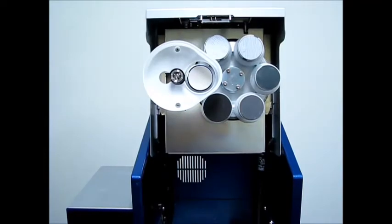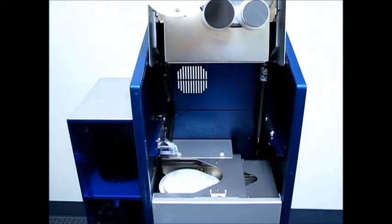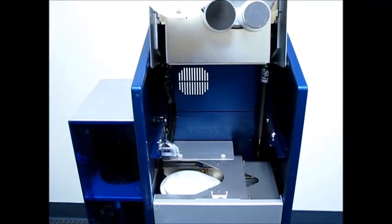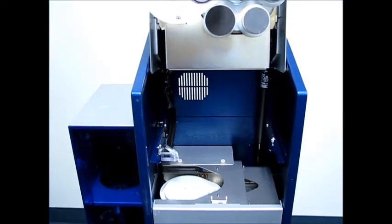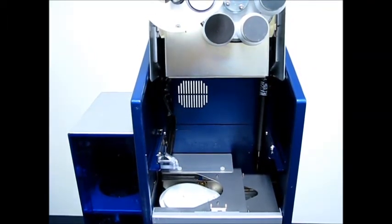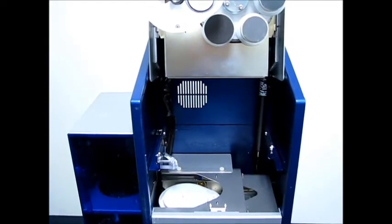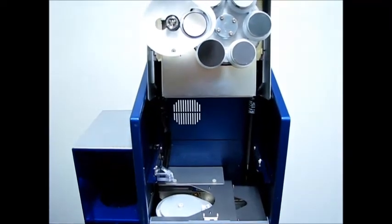And then down on the bottom, you'll want to clean that white plating table. Toothbrush usually helps getting in between the fingers of that white mat. And then get that under splash cover as best as possible. And then you'll wipe up any other little splatters that may be in the machine. That's your daily cleaning.